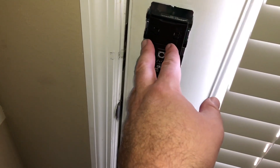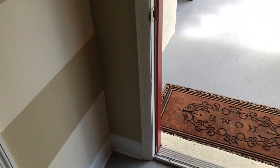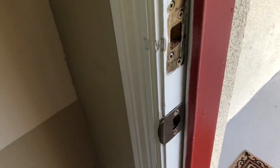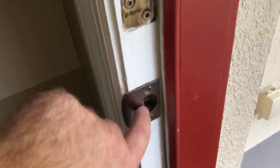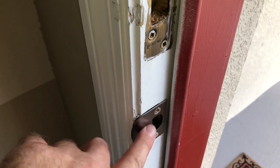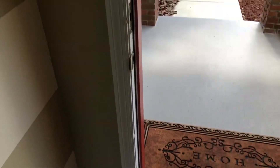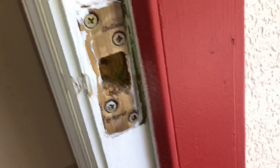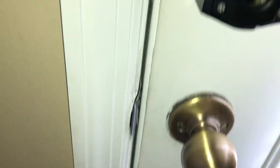I'll program the new lock when I find the batteries and fix the striker plate. The perfect alignment was found by buying another striker plate and putting it over the top of the other one — it was just the right thickness to move things where I needed from the little catch lip. There's enough clearance depth-wise where it still doesn't hit anything, and now I get a perfect seal into the weather stripping — no more bugs crawling underneath and around the door, no more heat leaking out. No daylight. Perfect seal.